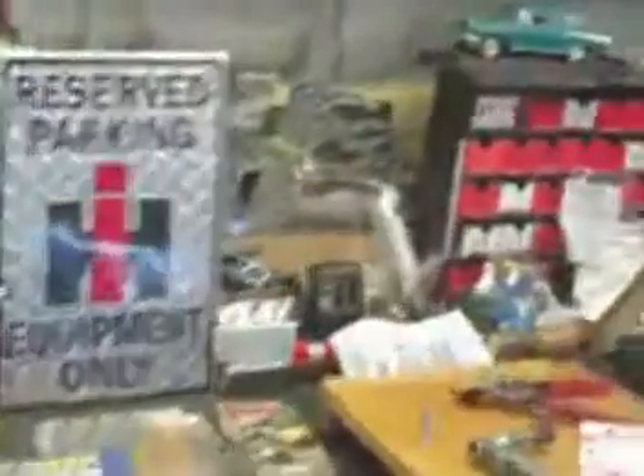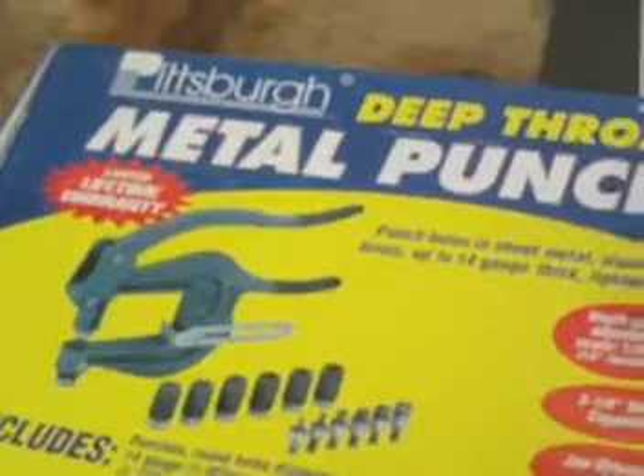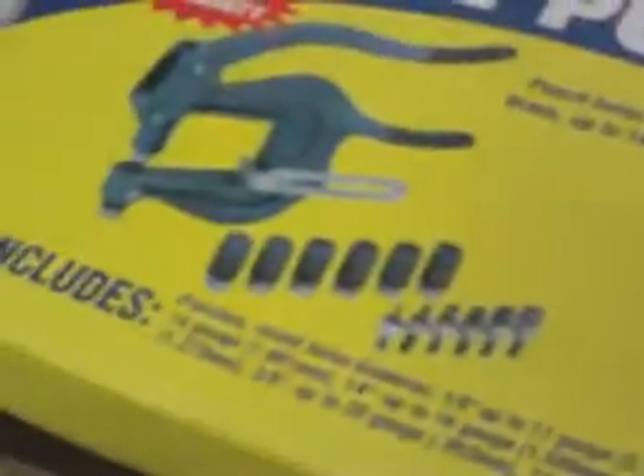What I wanted to show you today is a way to make gaskets. I got sick of waiting for companies to make these — they were like two dollars a gasket. So I bought this punch from Harbor Freight, pretty cheap, about 25 bucks. Then I got a plate, chamfered the holes, made a taper in there so the punch goes into the hole — the hole has to be one step bigger than the die itself. Then I put a bolt in the hole like this.